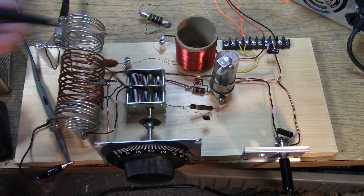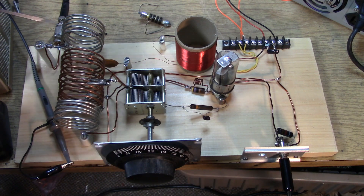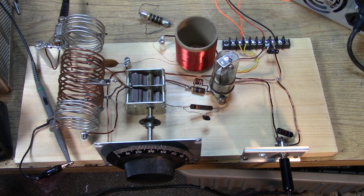If you can get one watt out of a 6J5, think what you could do at 200, 250, or 275 volts — tempt the devil and see if you can get more power out of it. However, you will find that you may need to loosen up the link coupling as you increase the power output, because you're not going to get that beautiful note we're getting now once you start to put more dissipation into the tube. You're going to get more drift and the signal may get a little dirtier. Right now we have a beautiful sine wave coming out of this thing.